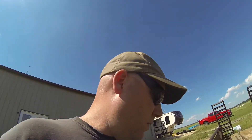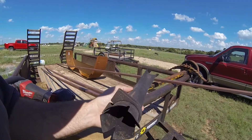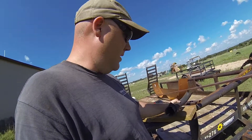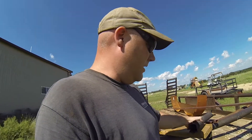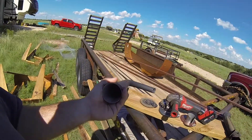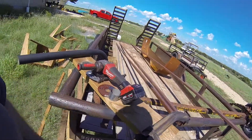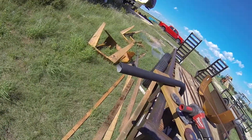While the paint is drying on the seat I can't put the rest of it together right now, so I'm working on the exhaust stack. This is the one it came with, which is obviously totally broken. Replacements are not available from Kubota either, so I went to a local muffler shop to have them build me one and it was going to be like $250 — so I said no, I can do it myself. I have the exhaust manifold and the muffler; all I need is a stack. I got a piece of two-inch conduit with the bend in it like it's supposed to have. Two-inch conduit is slightly too big, so I need to cut some reliefs — like this has — so it'll bend in and clamp down nice and tight. I'll just cut some one-inch reliefs with a little zip disk; shouldn't take long, probably just a few minutes.